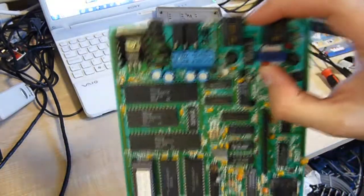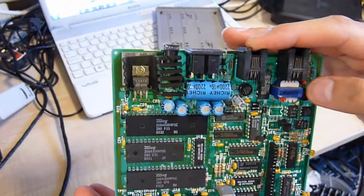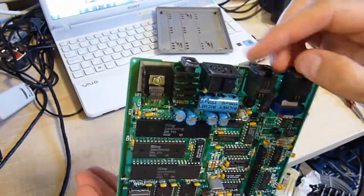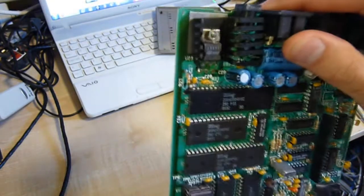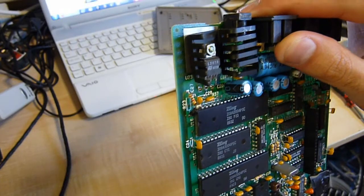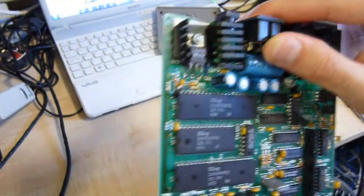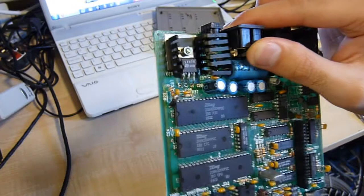Now, because this is a nice old style terminal, it's got its own modem built in, which is why you've got optocouplers and all those whatchamacallits there. A nice transformer, you've got two. I'd imagine one would be a send or receive line, or allow you to daisy chain different devices together. An RS232 serial port, which I'm currently still trying to work out how to power. A voltage regulator of some kind, which is an L387A, I'd imagine switch mode. It takes an AC input, even though I give it a DC, but hey, such is life. It's happy. This is pretty hot because I've had it on.